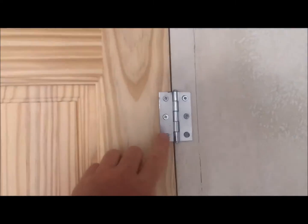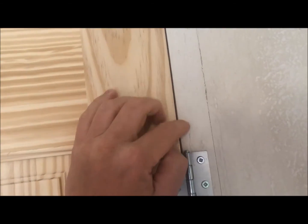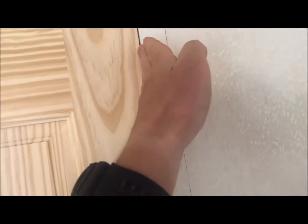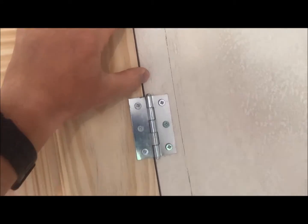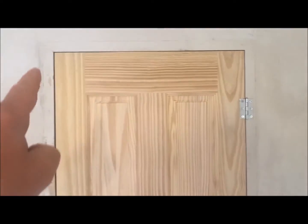And then we really start to get going on the shortcuts. So normally you don't mount a hinge like this. You chisel out a little bit of the door and a little bit of the door lining, and then the hinge will fit in closed inside here, so just this barrel is showing on the edge. So if you do that with both hinges, that's really quick to do. Before you screw those on, all you do is you take the door at the bottom and you just rest it on some doubled over corrugated cardboard and act as a spacer. Okay. And as you can see, you're looking for a kind of fairly equal gap all the way around.